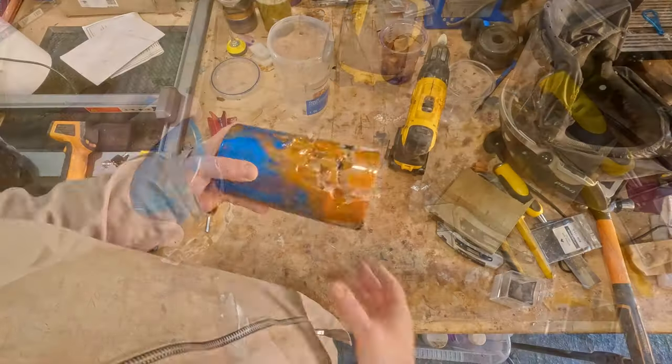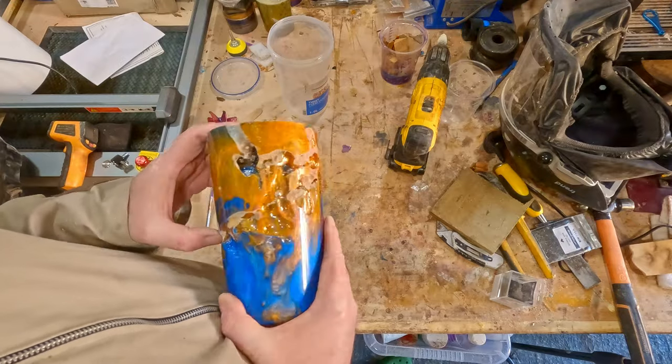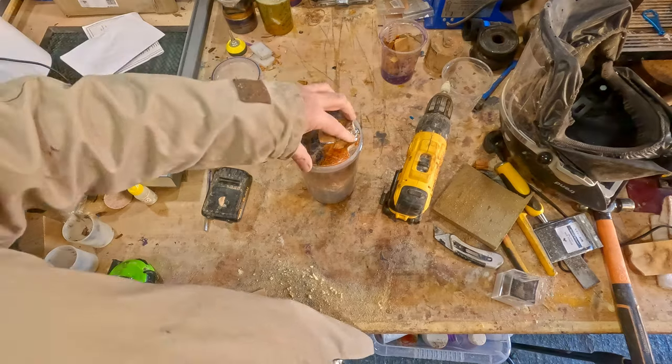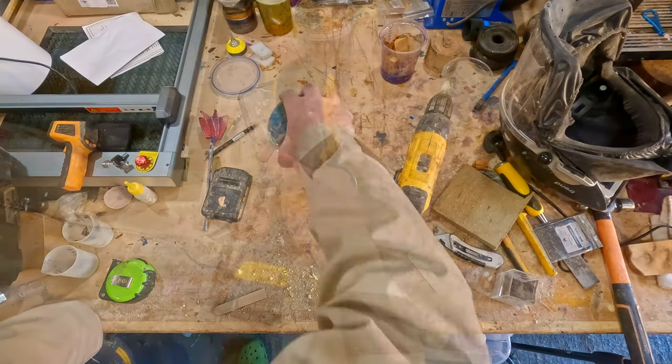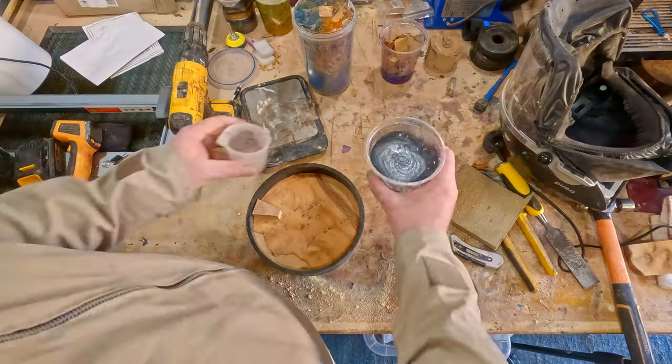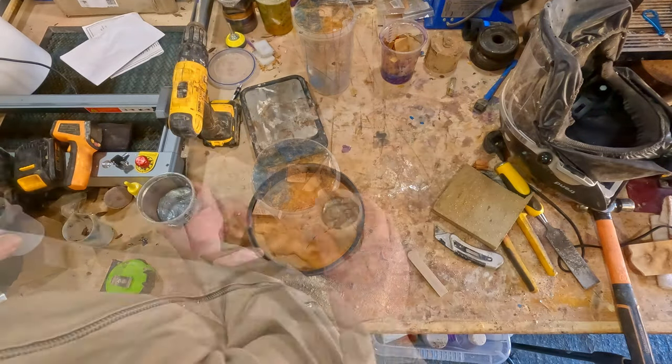Compressed air took care of the cleanup, then it was put back in the mould. I mixed a batch of resin with steel silver mica powder, and this was poured into the area to be repaired. I had to stop and add some packing tape. This created a reservoir that I could fill to make sure the voids would be filled to the top.